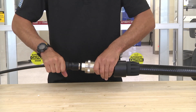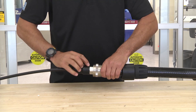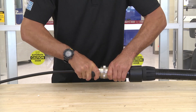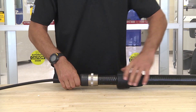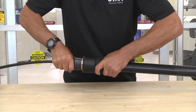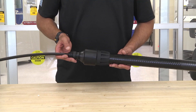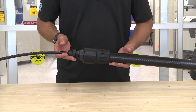Take your WPS-4A, 4S, whatever, and slide it up over the port seal. Take your adapter and push it up, making sure it mates with the inch and five-eighth connector. Slide your WPS-7 up and over the adapter. This installation process works for both inch and a quarter and inch and five-eighth. Now your installation is complete.